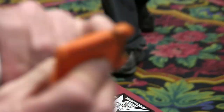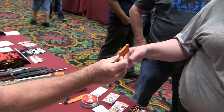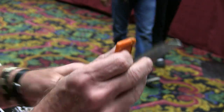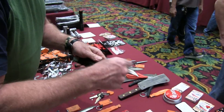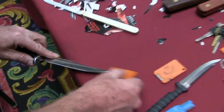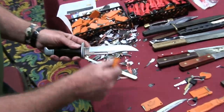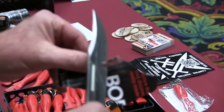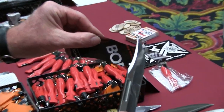The pocket is brushed — there's a hard sharp corner, tungsten carbide. All you got to do is get it on there like this. Don't push too hard, let it work. Brush down the blade, come right around the radius and the tip of the blade. Push light — if you're too hard you make another wire edge on the blade, so push light to take the wire edge off.